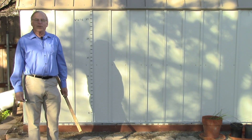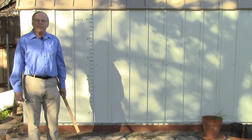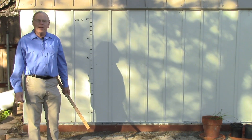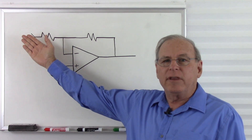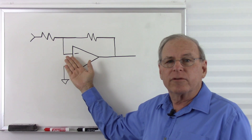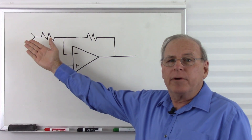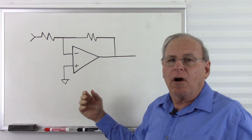Hello Dave. I'm making this video in response to your video on operational amplifiers, particularly the section on inverting amplifiers, where you said people become confused because of the signal at the input to the amplifier that seems to disappear at the virtual ground. The confusion happens because people see an input at this point, but by the time we get to the amplifier it's zero volts. The other input is also zero volts, so the inputs to the amplifier are always zero. So how can an input here have any effect on the output if the two inputs to the amplifier are always zero volts?